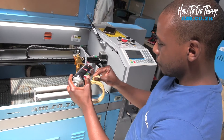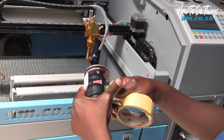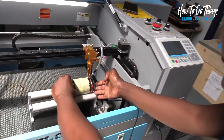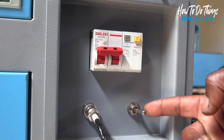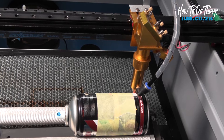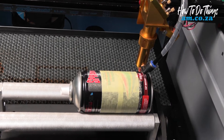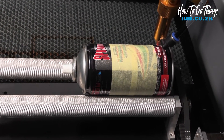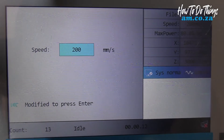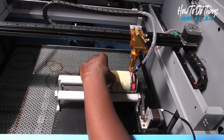I'm going to tape my cylinder with some masking tape, mark my origin, and then flip my switch to turn on the rotary attachment and test if it's rotating. I would also want to reduce my overall speed of the axis by 50% — it was on 200mm per second, so I'm going to put it onto 100mm per second.